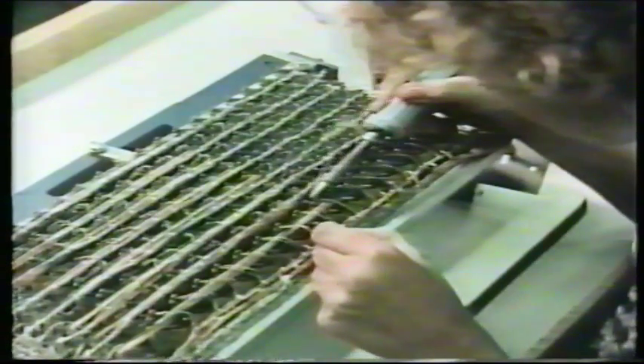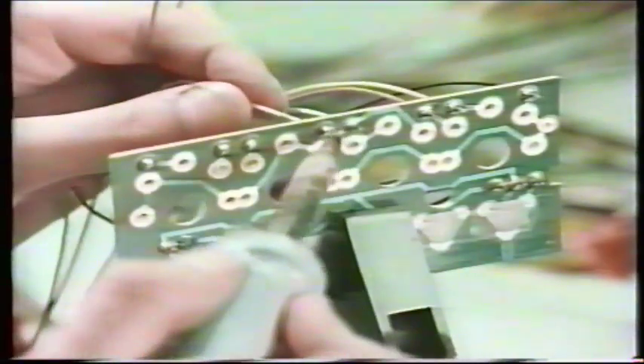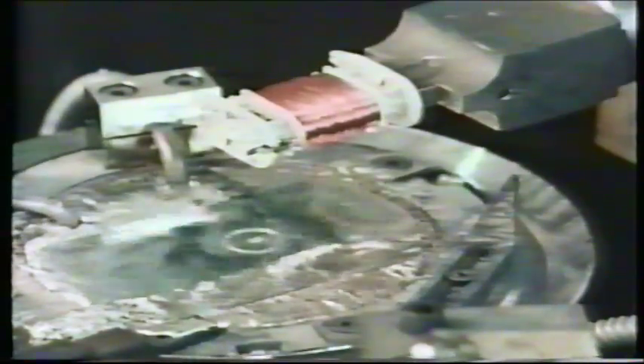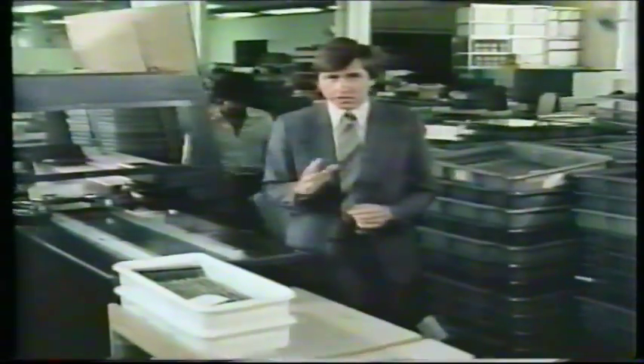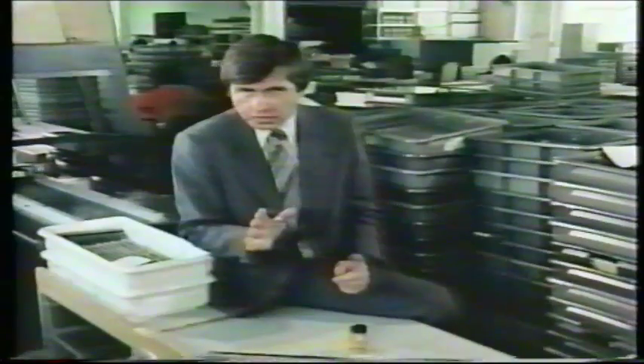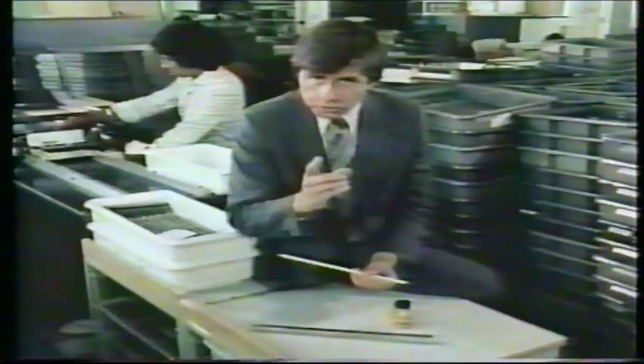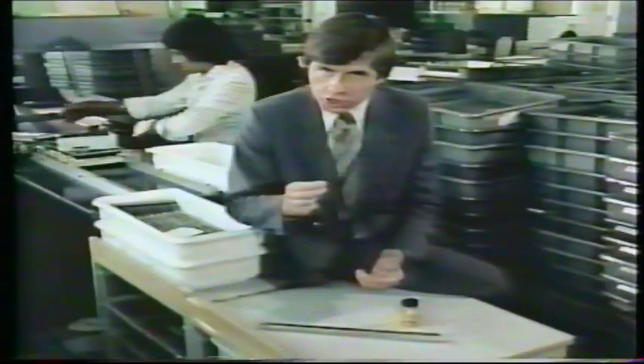It's as well to remember that a plain copper bit using a copper-containing solder, or a long-life ironclad bit, will reduce erosion and increase bit life. When it comes to mechanical soldering, dipping is perhaps the simplest to control and is often used for special jobs, such as securing coil ends to tags. Controlling the mass soldering operation requires an understanding of the elements involved in making a soldered joint: flux, solder, and enough heat to raise their temperature high enough to do the job. But it is important to choose the correct parameters for all three in order to achieve a reliable joint.